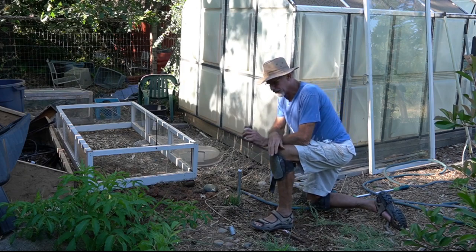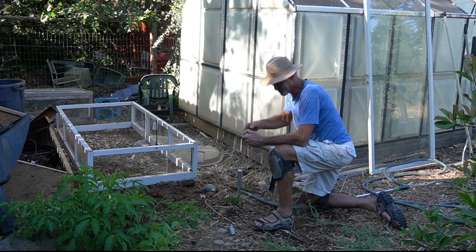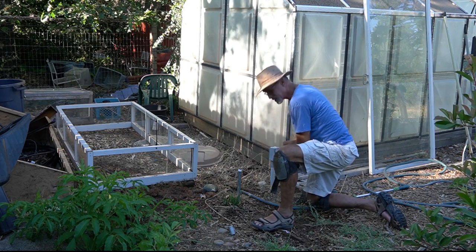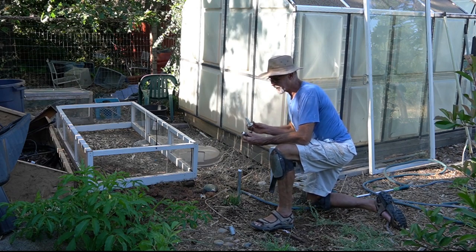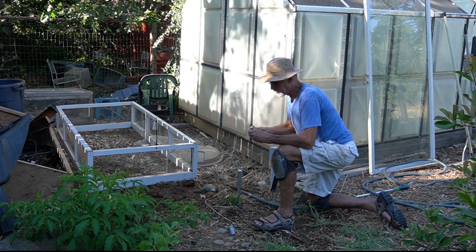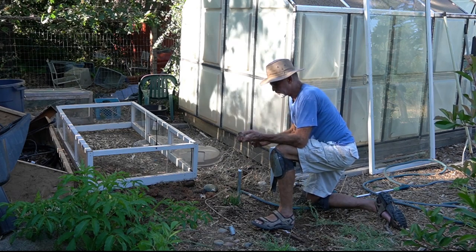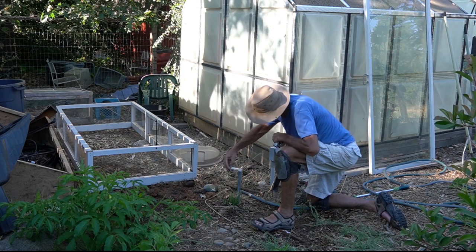And now here's something I learned from an old plumber 1,000 years ago. Not 1,000 years, I'm not that old, but long ago. Put some Teflon tape on there and a little bit of the pipe thread compound, commonly called pipe dope. Since I started doing that, and it's been a lot of years, I've had really good luck avoiding any kind of a leak. This thread sealant's pretty old, so it's a little hard to get it on here. It's almost as thick as putty.